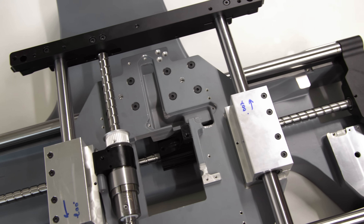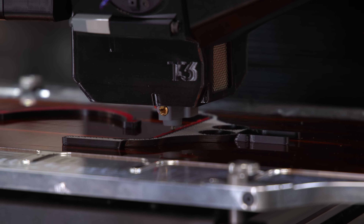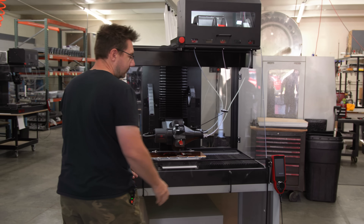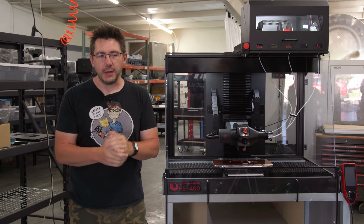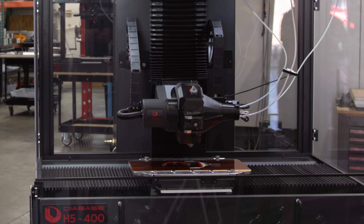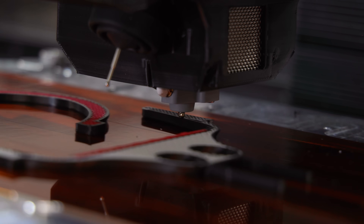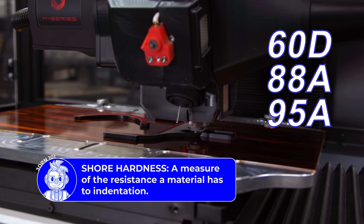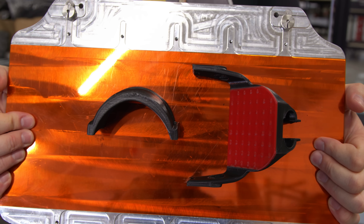The idea behind the H-Series is to build a CNC platform that can also 3D print. Let me remove the front — I want to show you what it's making right now. The H5-Series of machines, including the 400 that you see right here, can have additive or milling machine heads on the turret tool changer. Right now, this is set up to do three different materials via additive manufacturing. We've got a 60D, an 88A, and a 95A in shore hardness. And this is making these parts right here. This is a build plate from the machine.